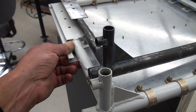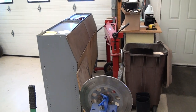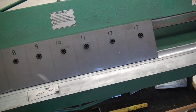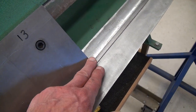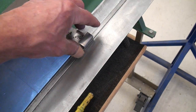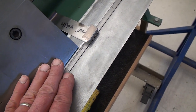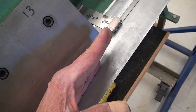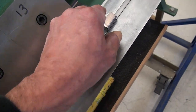Well, it's kind of hard to make that on a regular box and pan brake, and I'll show you why. If you take a look at my 36 inch brake over here — I got it at a local industrial hardware shop — you can see how the fingers extend down at an angle, and this is where the bend takes place right here. If you have a cord on a piece of sheet metal that's longer than the gap where it bends, it'll ride up against this finger and won't close down at a 90. In other words, when you take your piece of sheet metal, roll it up to a 90, scoot it out 3/8 of an inch, and then try to complete the bend, the top of the sheet metal hits up against this finger. And this is the end result.